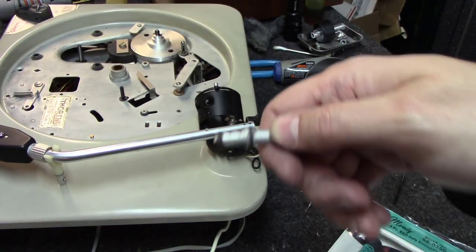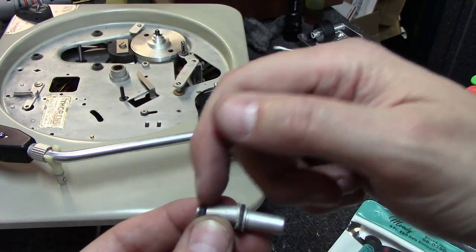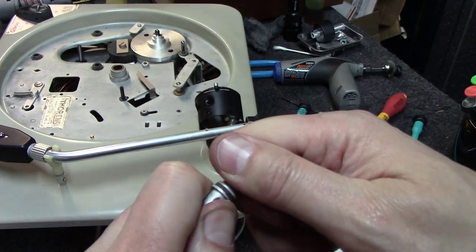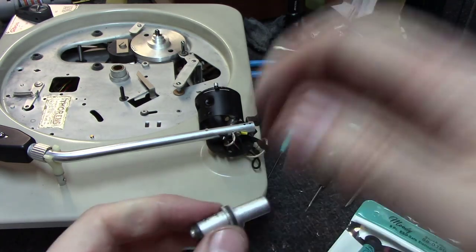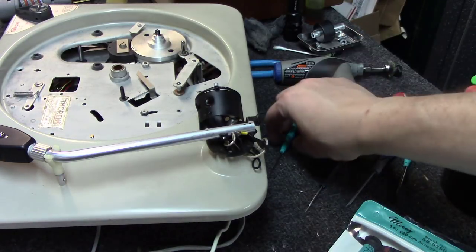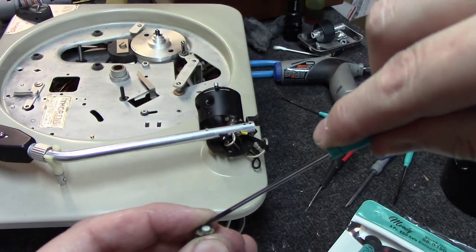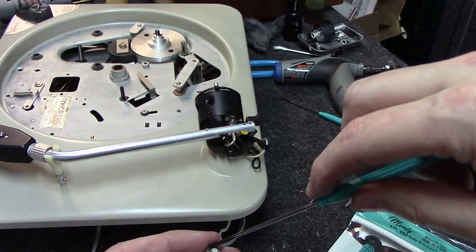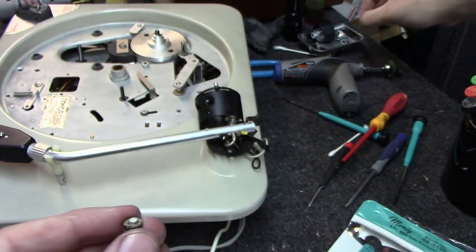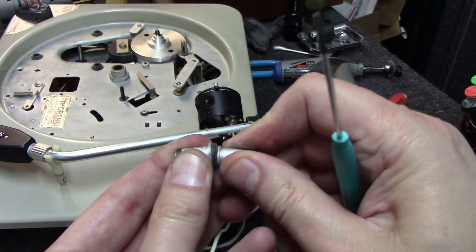And then this just pulls out. And this is the whole issue right here. This used to be a rubber grommet in between here, and this rubber is just completely gone at this point, and it lets it bend over like that. Just a teeny little E-clip on this end, so you have to get a small screwdriver of some sort and get that little E-clip off. And I'm going to put the camera up so I don't end up... Actually, I got it here. Didn't want to lose that. Get that into the magnetic container. At that point, this should pull out and...